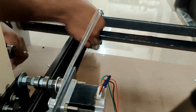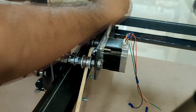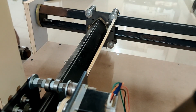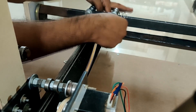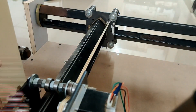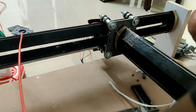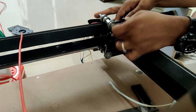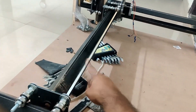You put the timing belt through the timing pulley and it will rest on the bearings roughly in the center. Everything needs to be aligned — if it is not, you have to take it apart and make sure they are properly aligned. Basically the belt should go through the center of the timing pulley on the motor, the center of the bearings, and the center of the belt holder. Tighten it reasonably on this side, and on the other side you have to make sure you are pulling it really hard before you tighten it. It is done and it is really tight.